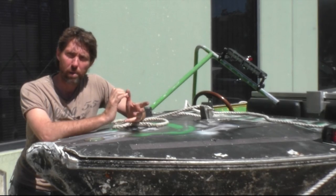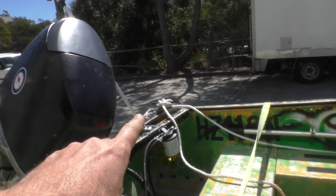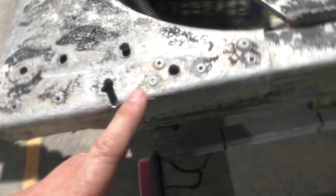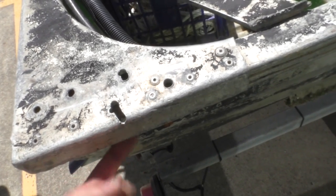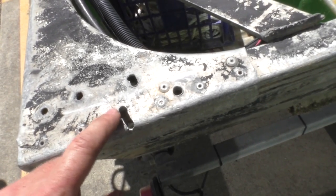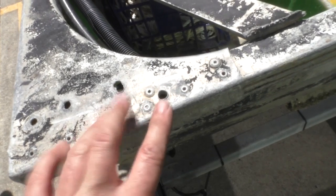As well as a few planned modifications, I've also got to do a few repairs, so I'll show you those first. On the far side over there, you can see I've got a cleat there, and there was one here. During a storm, over about three days, the nut here got loose - that's my bad for letting that happen - but once there was a little bit of play, it just started sawing its way through the hull. So I've got to repair and fix that.